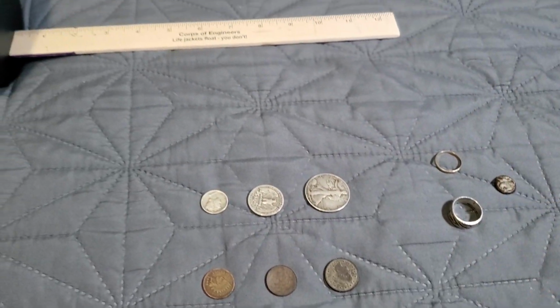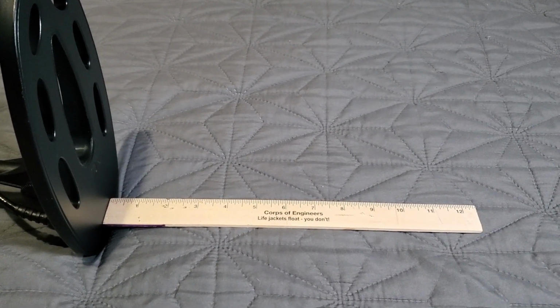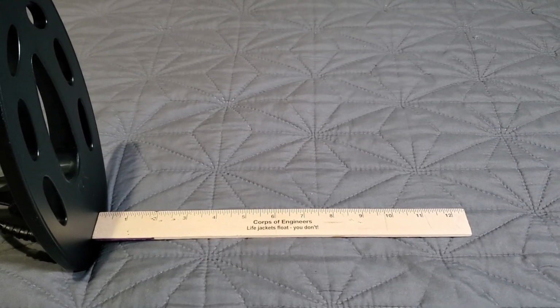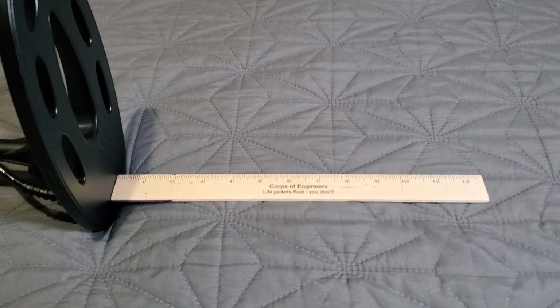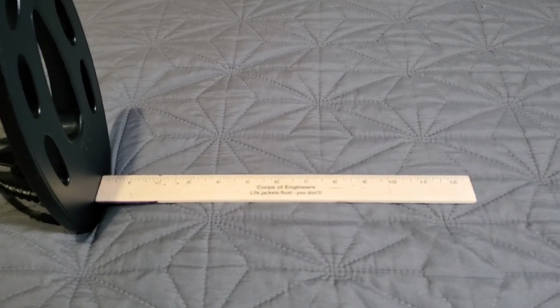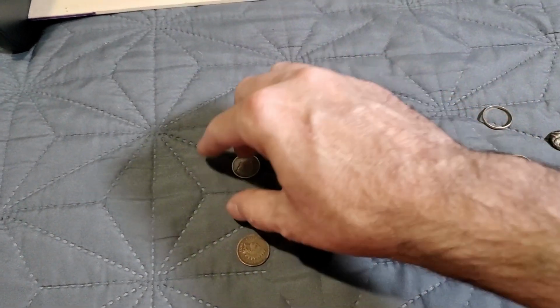We'll make it quick. I don't want to spend too much time on this. I have it maxed out to 99. It's popping and spitting just a little bit. It is in the Deep 2 mode, which is the 60 hertz filter, and then it is in the D1 tone mode. It gets a little complicated here. The D1 tone mode is all VCO tone all the way across the board, super modulated audio.